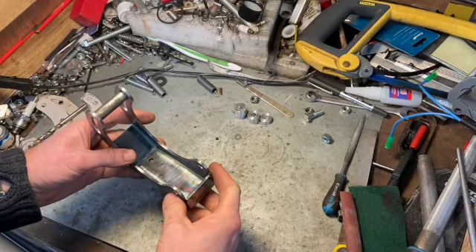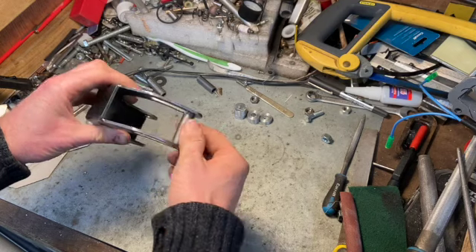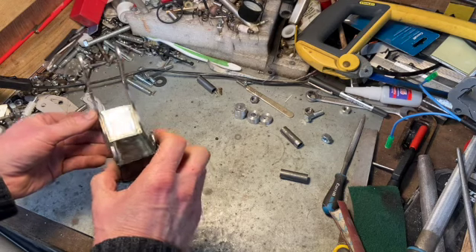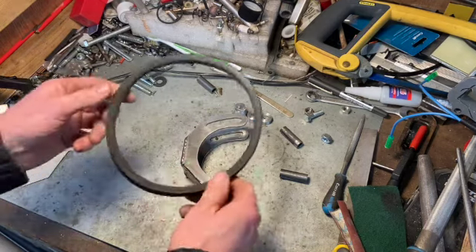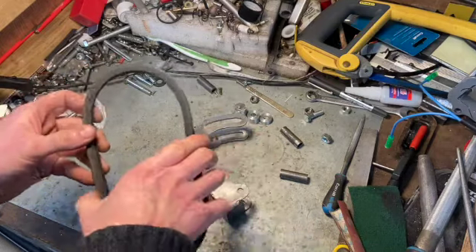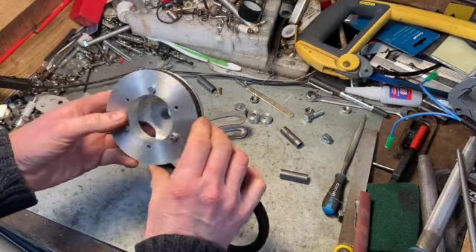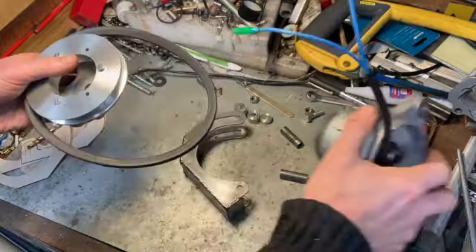Back at the bench after lots of filing, fettling and welding — we now have the bracket. The spacers visible in the welding video were just to hold everything in place while welding. It took a long time because of problems with the bandsaw, but that turned out to be fortuitous — the bandsaw's belt was about the right size, which let me play around with the pulley again. I've machined off much more material, changed the angle slightly, and now the belt fits in my pulley perfectly and also fits around the alternator perfectly.